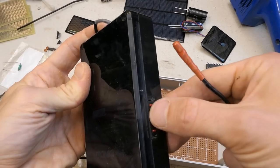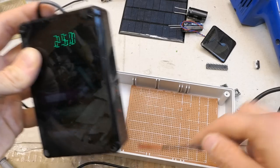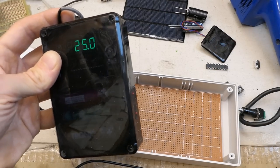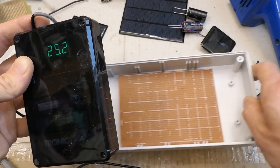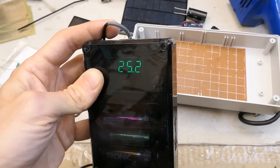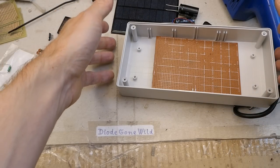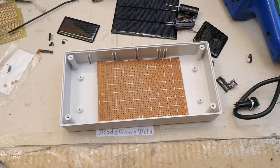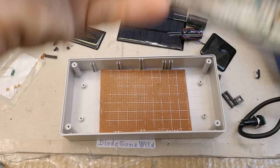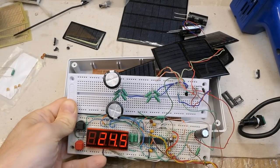I already did this style in a previous unit — this is more like a laboratory thermometer with a probe on a cable. The new one will also have a cable with a probe going outside measuring outdoor temperature. The previous one goes up to 150°C; this new one will be up to 99°C, which is enough for indoor or outdoor use. A narrower range may make the measurement a bit more precise, and I've been testing this idea on a breadboard for a couple of months.